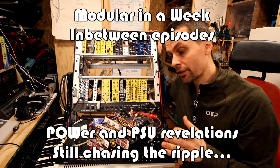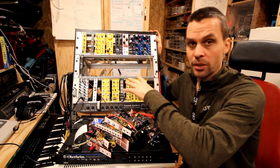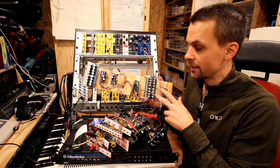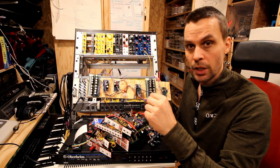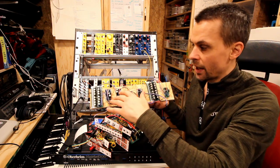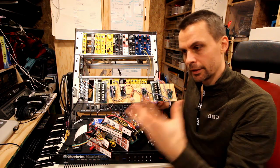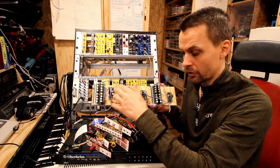Hello and welcome to another in-between episode of Modular in a Week. No project today — I am rearranging my rack mainly because of two things. This middle shelf has been power managed by four of the first power supplies, the small power supplies PSU-05. That has been in this rack shelf together with arrays of extra capacitors to bump up the capacitance and remove some of the ripple that these had, because the capacitors are so small.